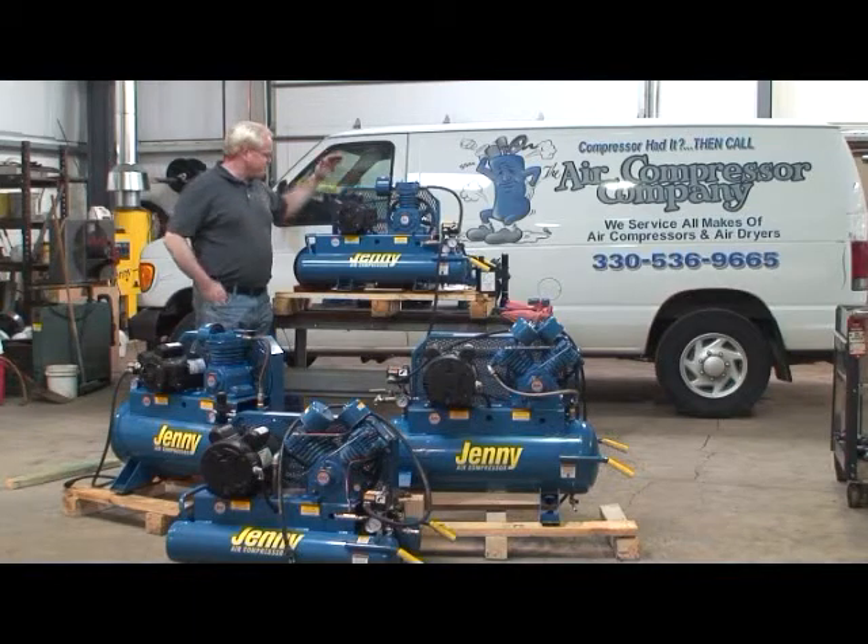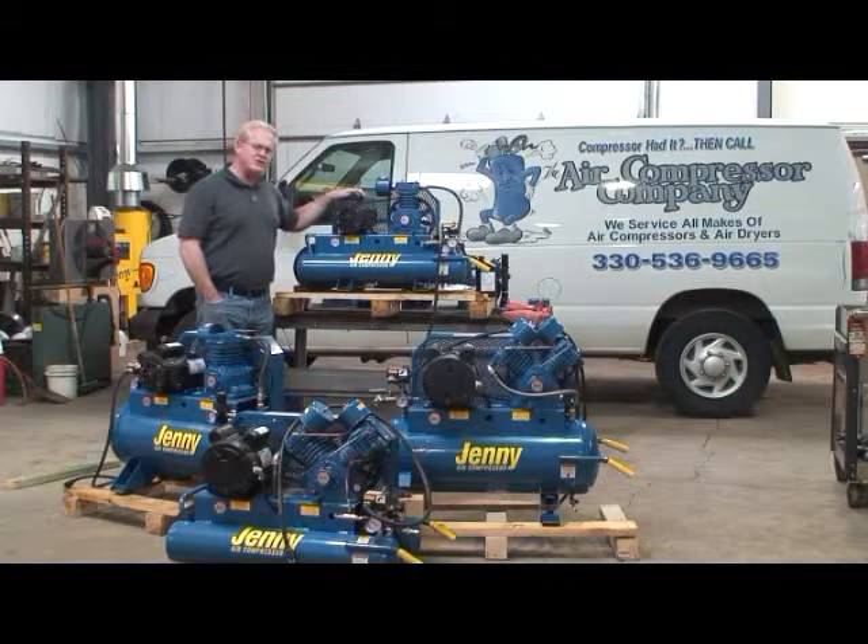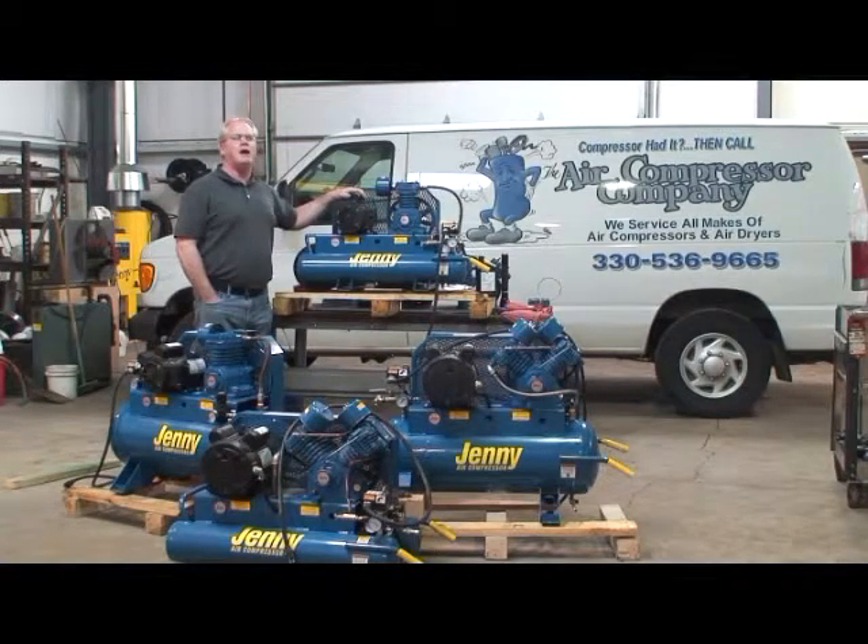Also, when servicing these electric motors, if you have too small of an electrical supply, you can encounter a condition where the motor will not come all the way up to speed or will run in an up-and-down RPM type situation. Again, that points toward either insufficient voltage or a low amperage situation. If you continue to run the motor in that condition, it will undoubtedly lead to a winding failure.